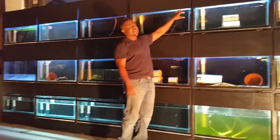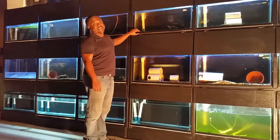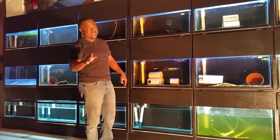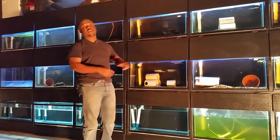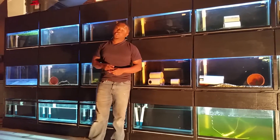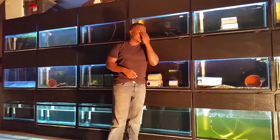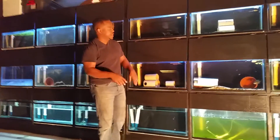We have an inlet over here on this side and we have a solar setup on this side. It's not a U, it's a T, so you don't trigger the siphon and drain all the water out — a lot of people are doing that. All we have to do is drill a hole in the tanks and use bulkhead fittings, which we also have in different sizes that you can buy on our site. We really believe in this fitting; it's a good fitting, it works, they designed it very well.